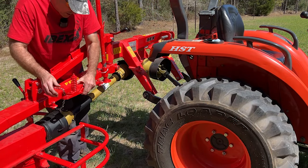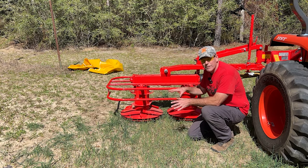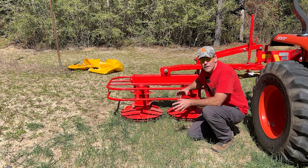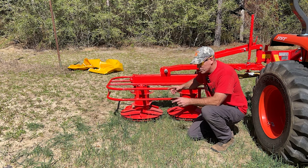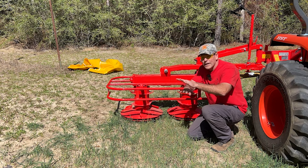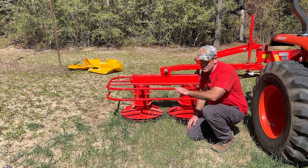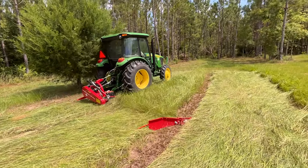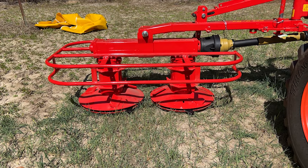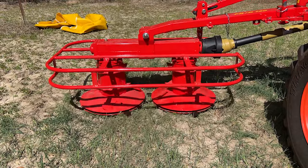Put it in operation mode and see if I've got the right angle here — I'll adjust that as I go. What we don't want is the drums leaning forward and these blades hitting dirt, as that'll quickly dull the blades. This is called a drum conditioning mower. If this grass was taller, what you'd see is all of the cuttings come through the center here and hit these sharp lands that are angled up, actually laying it over in a crisscross pattern — that allows it to dry better than a sickle bar mower that cuts it low. This actually will kind of ted it a little bit and raise it off the ground so it'll dry better and quicker. That's the first time we've spun the drums since we've had it put together, and they spin pretty fast. So let's take a shot at mowing.